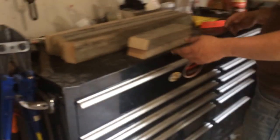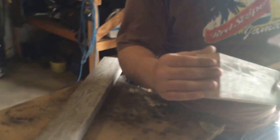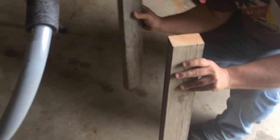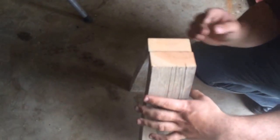I'm going to grab these and show you how to build one of the basic A-frame legs. These are cut on the bottom at a twenty-two and a half degree angle, so it's perpendicular or flush with the floor. We need to cut them at a forty-five at the top — I'll show you in just a minute and you'll see why. Come over to the saw and we'll cut one of these to a forty-five degree angle.